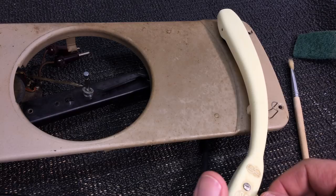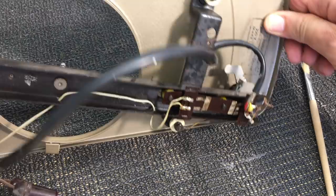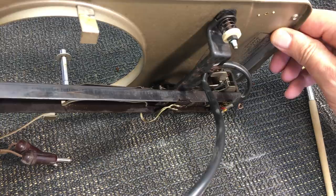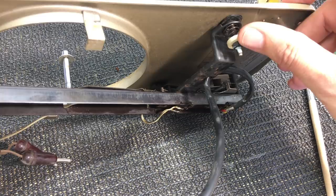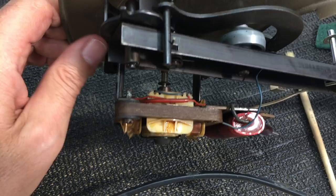And fortunately, there isn't that much of a mechanical puzzle going on here. So it's quite easy to see how it works on the underside, and it's all in place. I mean, some of the springs had jumped out. It was just a matter of putting them back in place, but it seems to be working. I just need to do some cleaning, and I need to check out these things are connected on here with springs so that there's some sort of suspension. I see some of the rubbers on the motor are dead. Some of the rubber grommets that suspend the motor are dry, so I need to replace those. And then I'll be ready to test this thing.